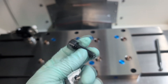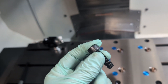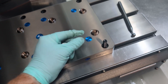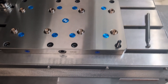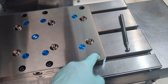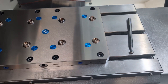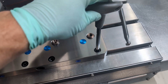The threads I bought to use are these T-nuts. This is an M10 socket cap screw, and the length of the threads is just 30 millimeters, and it fits perfectly in here. The 8 millimeter — a few comments said that would be good, and even I thought so — but 8 mil is just too small. The 10 is perfect. When I went in and measured the counterbore, measured the hole, and then went to my reference sheet, it's just a little bit small for a 10, and that's even better than what they call out. As you can see, it slides in there well and picks up the threads just perfectly.